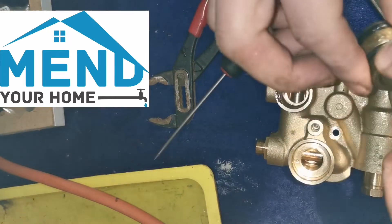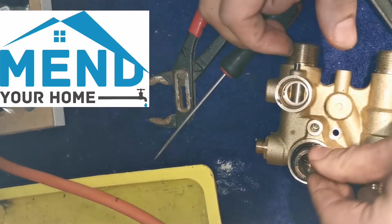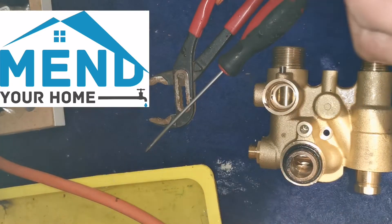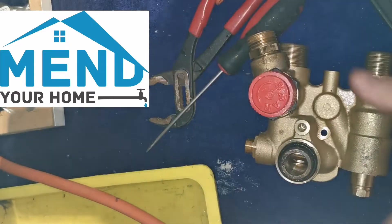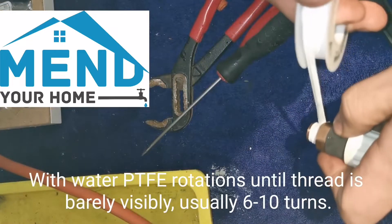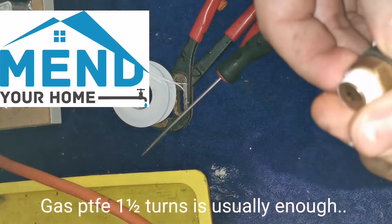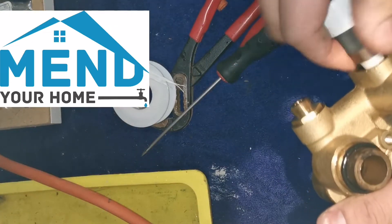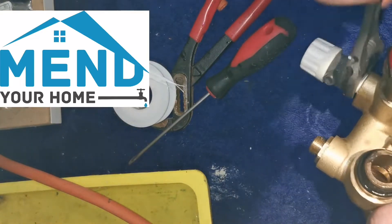Lube them up — sometimes you can use a bit of water or whatever you want. And it's a tight squeeze if you're up in the loft — you might even spit on it. Now this one you've got to move it to the side at a bit of an angle, which is a bit difficult — you just have to estimate. Over here I'm using water PTFE. I know a lot of the gas boys don't understand why I'm doing so many turns, because with gas you only do one and a half turns on gas PTFE, but with water PTFE you do it until you barely see the thread.